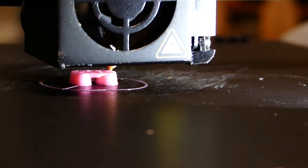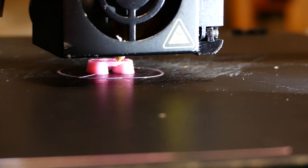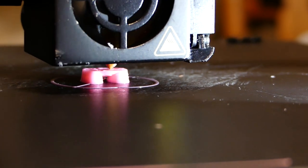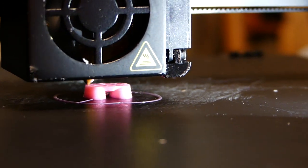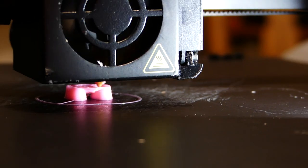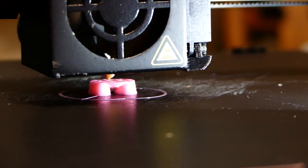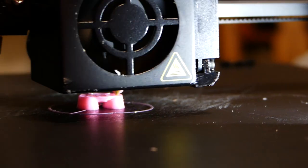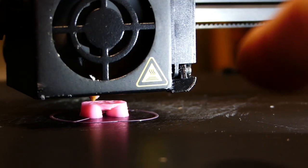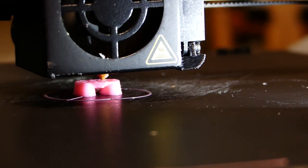Bad electrical connection for the Z stepper, but now that's not an issue. I reseated it, and I haven't had a problem since. I actually haven't even made any modifications to the printer. The cover for the feeder is cosmetic. The only two modifications you really need is a slightly improved blower piece, which is a 10-minute print. It's stupid easy.